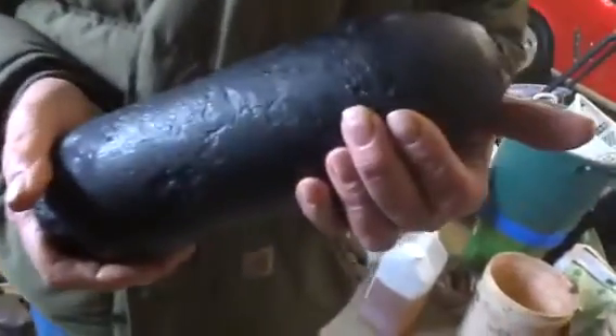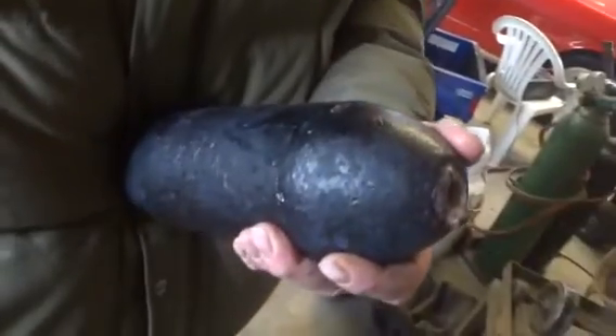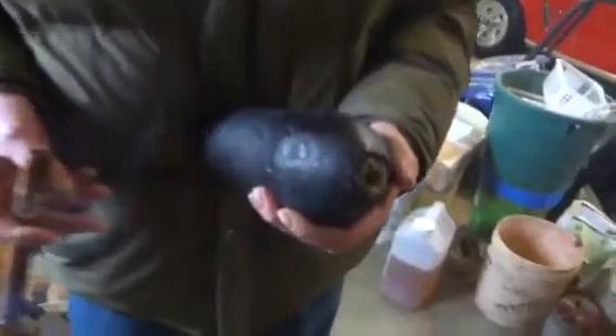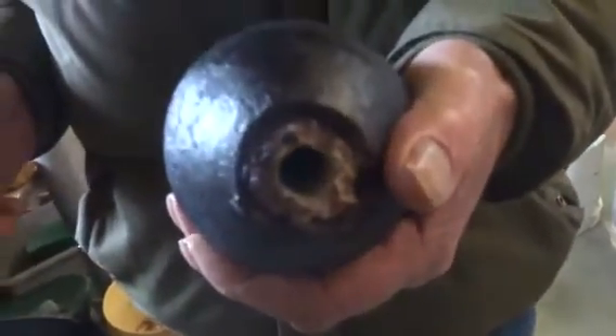There it is right there folks — it turned out real good. This was not a percussion fuse; it took a paper time fuse. I've unloaded it and cleaned it with reverse electrolysis, then used a tannic acid-based product called Rimpers rust converter. I preserved it on the inside and put a couple coats on the outside.